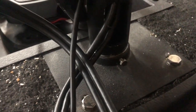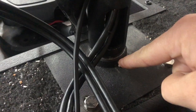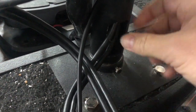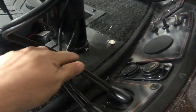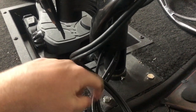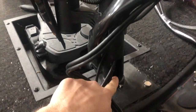If it was me, I would probably take this off, but it also causes some of the wobbliness in the pole — that's why I put this in here to lock it down. It has a lock nut holding this. I can take this out, unhook all this, pull the wire out, and remove this whole pole. If you go to your local metal shop or tractor supply, get a two-inch pipe, have it threaded, you could weld it onto the plate, tap it with a hole drill, and cut your hole right here to run the wires up.